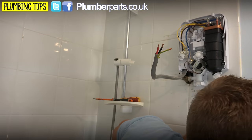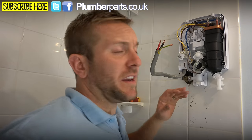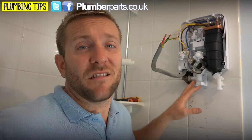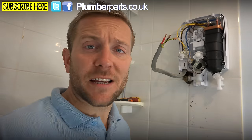So now what I'm going to do is grab my adjustables and tighten up this joint here. So now that we've got that tightened up, we can turn the water back on, test for leaks, and only then after that, follow the manufacturer's instructions. That's the best way of doing this. As I said, this is just a brief idea about how to do this sort of job. So I'm just going to turn the water back on now and test for leaks.